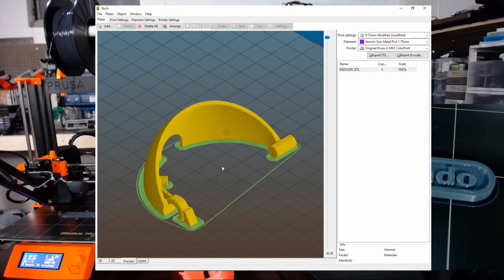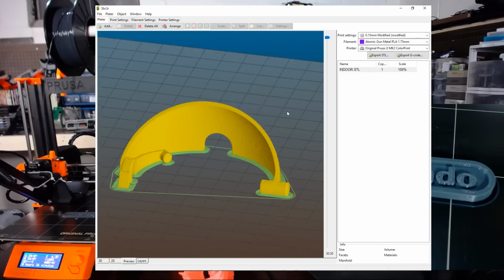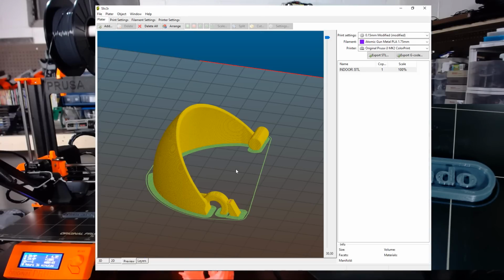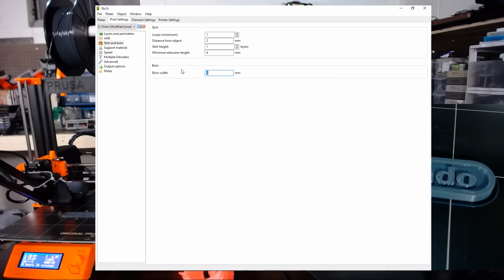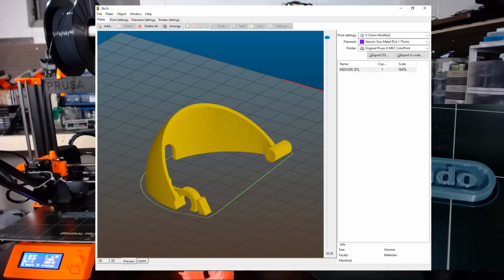And I guess Clusis, is that how you say your name? Clusis in chat says that the glue stick is better. And I can see that. If you don't have to have any extra stuff attached to your actual print piece, you would completely circumvent the problem of having it not break off clean. So I will have to try that on one of my newer prints. And Peter suggested that a raft is good with ABS in particular because it can help prevent warping, which again makes a lot of sense. But I thought it's worth touching on that while we had a minute.